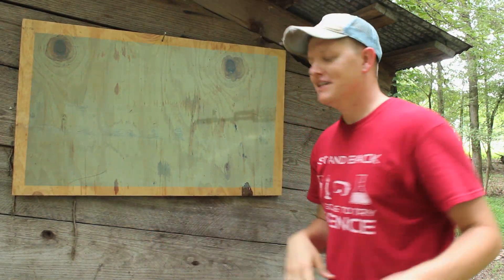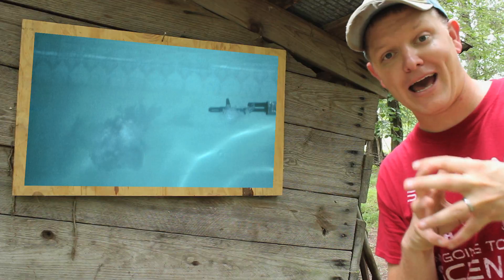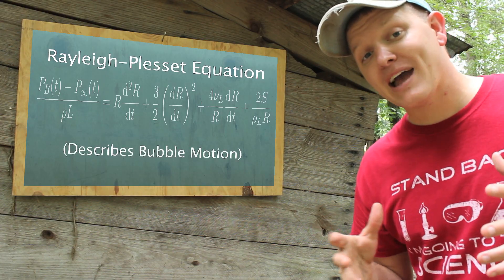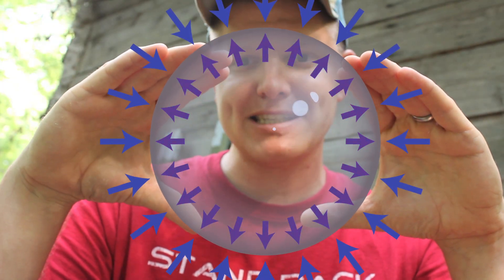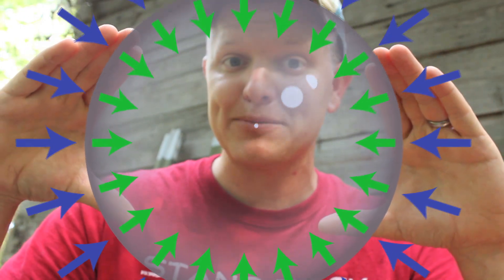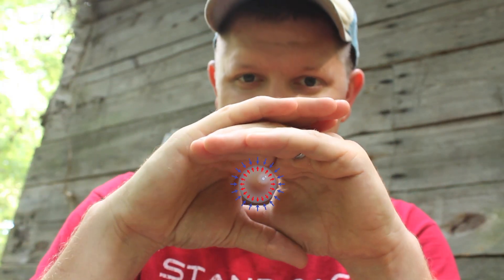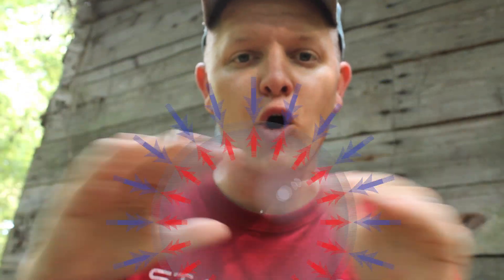Let me try to explain what I think is going on here. We got this oscillation that you can see after the shot and the bubbles. I didn't understand why the bubble would start back up after it collapsed. But here's what's going on. There's an equation called the Rayleigh-Plesset equation that describes everything a bubble does underwater — it's too hard to solve by hand, you've got to use computers. At the initiation point, you have super high pressure inside a bubble, and it begins to impart momentum to the fluid around it, so it begins to grow. At some point, it passes where pressure inside equals pressure outside, and it continues to grow until the water stops it. Now you have low pressure inside and high pressure outside, so it begins to collapse again. Because of fluid momentum, it goes again beyond that equilibrium point and begins to compress. So it gets super high pressure on the inside again, and boom — another shock wave, and the process starts all over again. This oscillation occurs until you dissipate all the kinetic energy in the system.